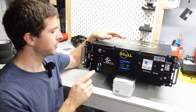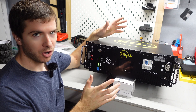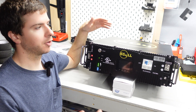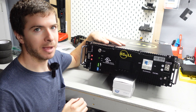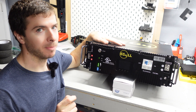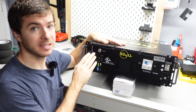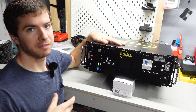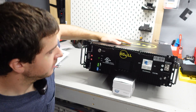These are well worth the money. Yes, you can build a DIY pack cheaper, but you won't get all the features — built-in fire suppression, overload and underload protection, and all the BMS features you'd want. I've had one for a year with zero troubles. They communicate with EG4 and other inverters using RS-485 protocol; you just need to check compatibility with your inverter. Rated at 100 amp output. I considered the bigger 280 amp hour, 14 kilowatt hour battery, but that one weighs almost 300 pounds. The nice thing about this 100-pound unit is I can remove it and use it with another inverter for a portable on-the-go system.